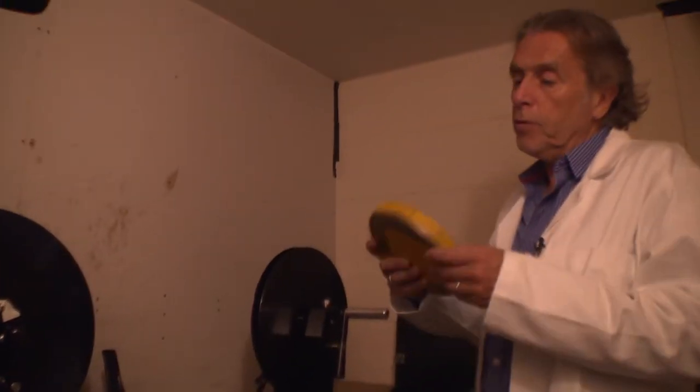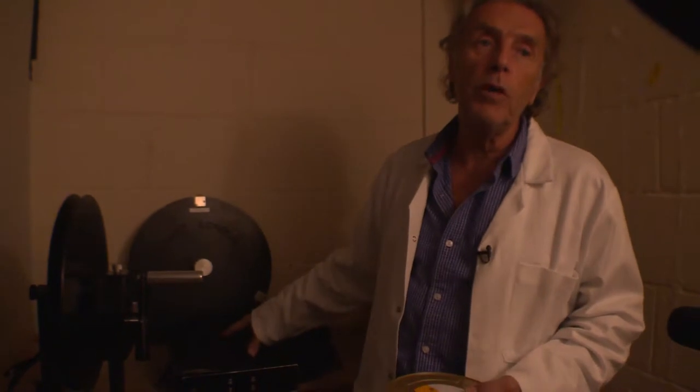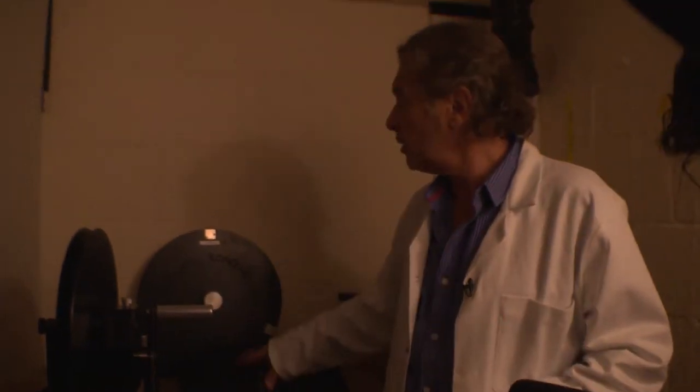So the first thing we'll do before we turn the light off, we're just going to take the tape off the cans and prepare them in light conditions. This is the magazine that all the film rolls of exposed material are going to be put into, which is light-tight Photomat magazines prior to processing. So this is what we're going to be doing in the dark now.